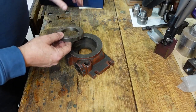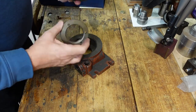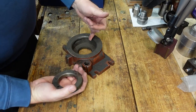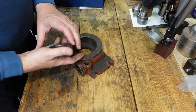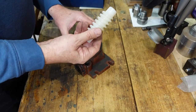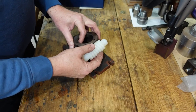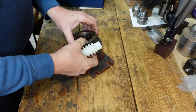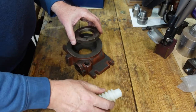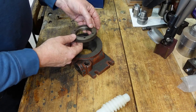This is the rotary table in question. There's the table part, this gear fastens up underneath, and in that hole there's basically a screw — that's what a worm is, a screw. As that turns, it slowly turns the gear, so one turn equals one tooth of the gear, making it really good for high-ratio reduction gearboxes running at low speed.